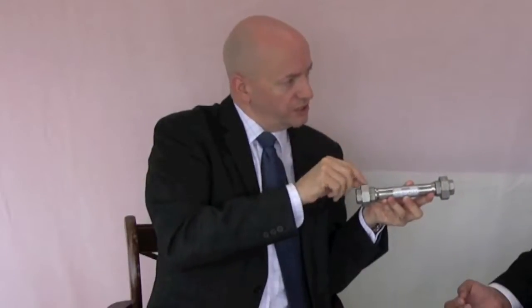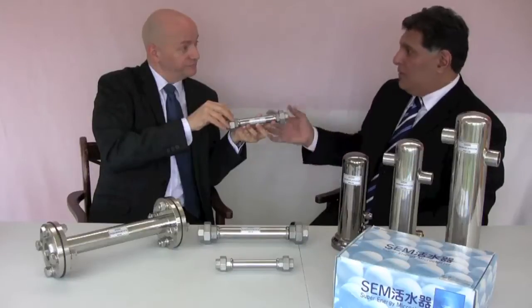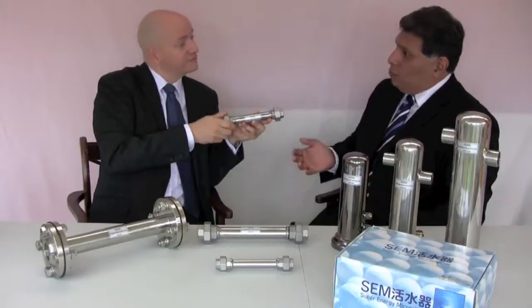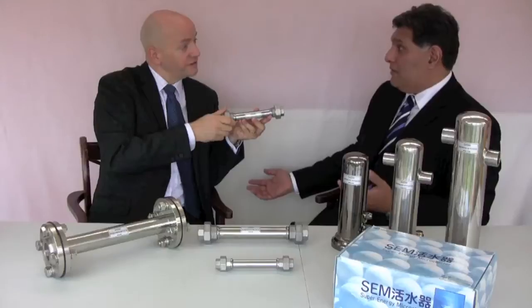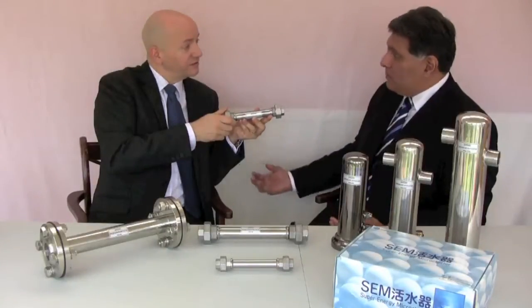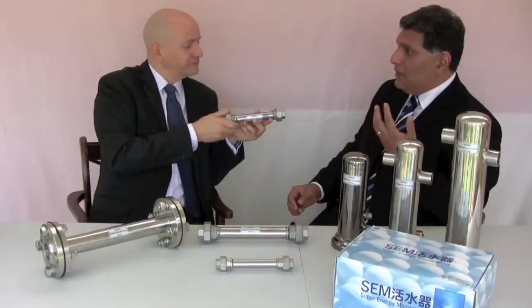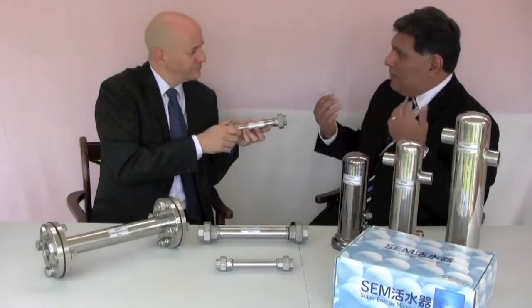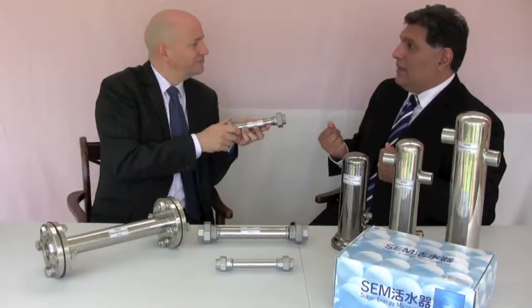You've got just about all the benefits. Without salt, of course, it means you can drink this. When you have a salt water softener, there's a sodium and chloride aspect. Calcium will bind with the chloride and that will go into the drain. What it does to the drain is also a big issue, because in certain states of America they've banned salt water softeners due to what it's doing to the groundwater or the sewage treatment system with the calcium and the chloride. And you are left with sodium in the water.